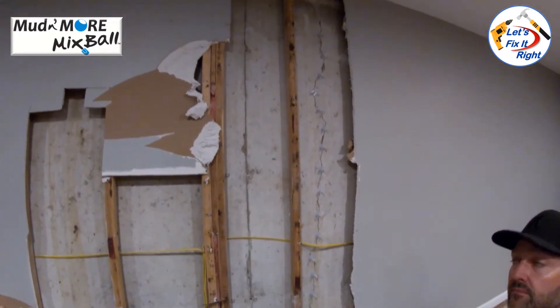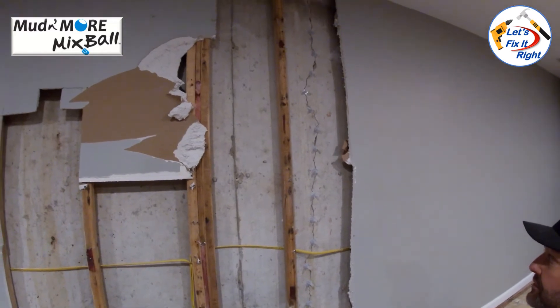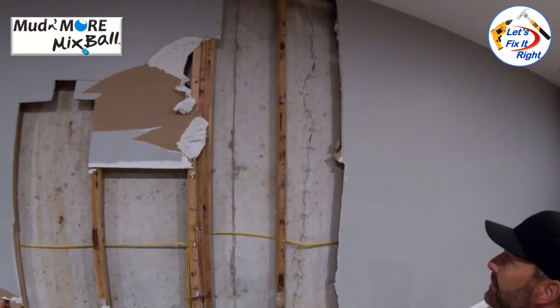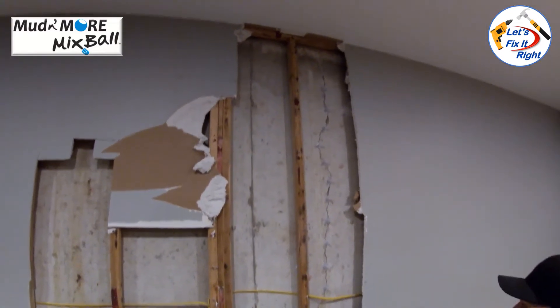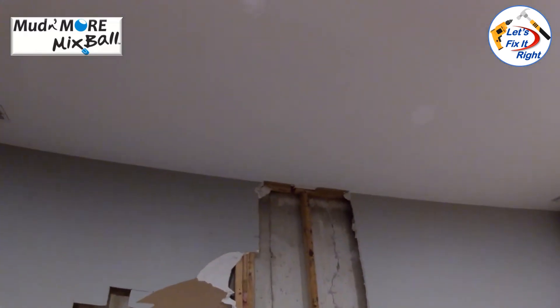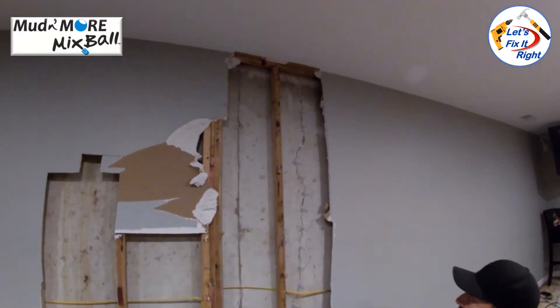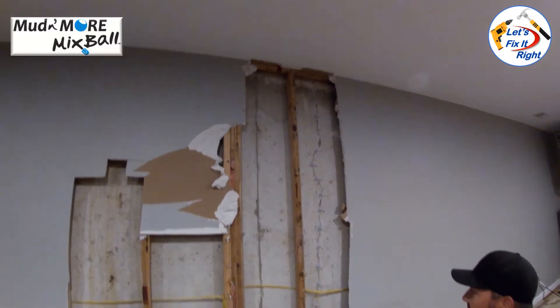How many houses have you repaired over the years? I didn't do this full time — I was a remodeling contractor — but every time I came across it, I've probably done at least two dozen of them. There are a couple more ports to put on at the top. I need to mix up some more epoxy, put those ports on, then cover the crack around the ports, and let that set up for about 25 to 30 minutes. Once that's set up good and hard, we'll go ahead and start pumping the injection epoxy in.